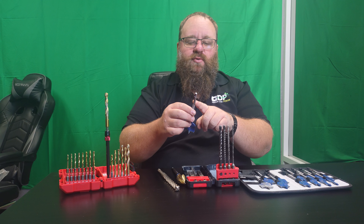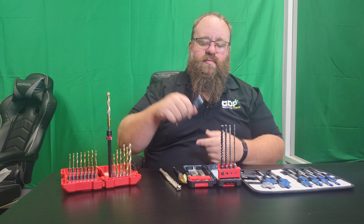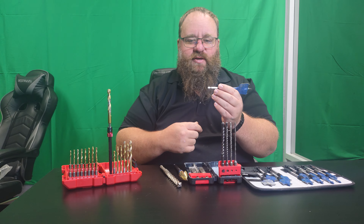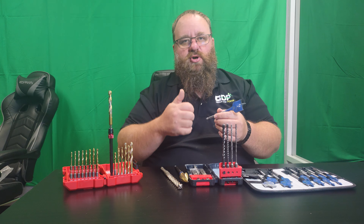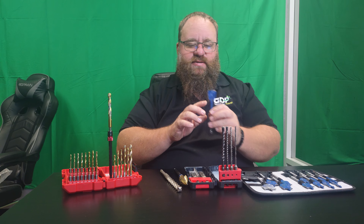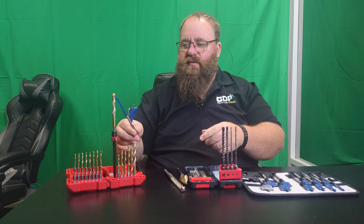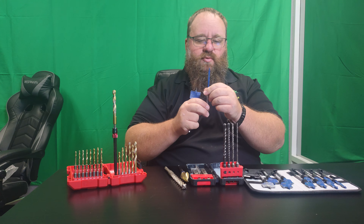The other thing you'll see on this particular version is that it's curved — these make it really easy to cut through wood. It is a giant improvement. So the curved with the corkscrew, hands down, is the only way you should ever buy a paddle bit. I like them with the quarter-inch shank so I can add extensions and run them in my impacts. I use impacts almost all the time now — I almost never switch over to a drill if I can help it.